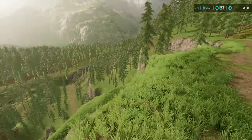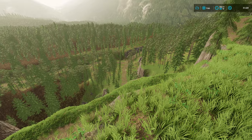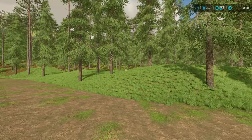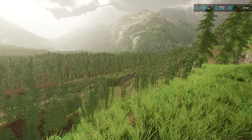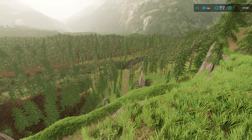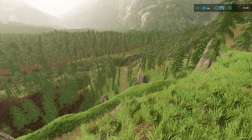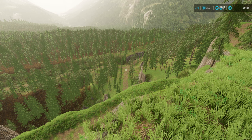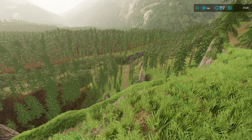We're going to put a yarder up here, connect a cable on one of the trees down there, but I think that one will actually be ideal because it's nice and centered on that road. And then we'll bring the logs just through here as we process them in there. We'll bring them here, just drop them here, hook them up to the yarder, and then run it down the cable and drop them somewhere down there. Which means we can then take a front loader down there and load it up to a truck and then run it into town. So yeah, that is the idea. The limit on that yarder is about 3 tons. So we should be able to get quite a few logs down there at a time.